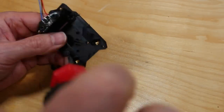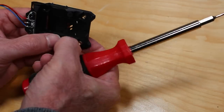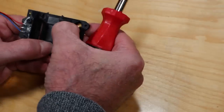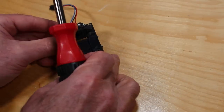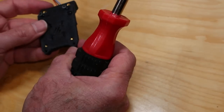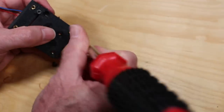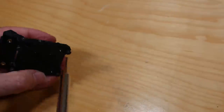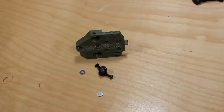Here we're inserting the flathead bolts — the magnets are going to attach to these. Make sure these are flush mount with the surface, and you want them to be pretty even, because these are the only two things that are actually holding the print head in place. Next come two small button head screws. Your print head's going to rest on these, though I ended up removing them in the end.